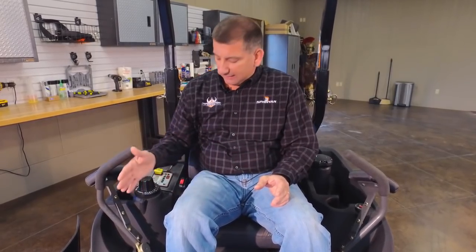Another thing that we've done on this is to have really large pulleys and really good wraps, so that we're able to leave our belt where it doesn't have to have a lot of tension on it because it's got so much wrap. So our deck system and belt system is designed to where no matter if it's all the way on the bottom setting or all the way on the top setting, it still keeps the same tension. A lot of times you'll have a deck that you let down, and then it'll be too tight, and when it's up, it's too loose. So with the geometry of how it's set up, we were able to get it to work so that the belt stayed the same tension the whole time.